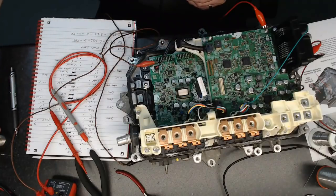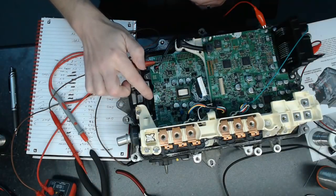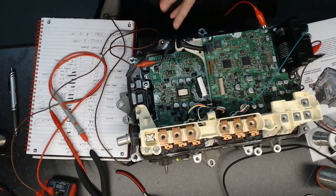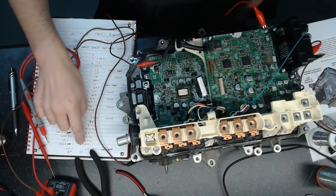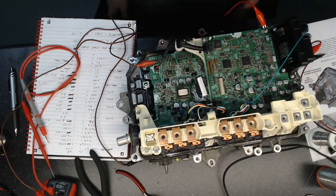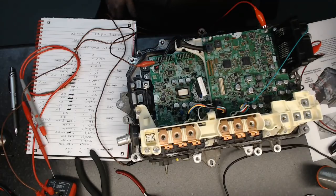And that should then bring up my gate driver. It certainly is bringing it up somewhat, so I've got to try and figure out if it needs another signal. You know, if it needs pin 50 and also possibly pin 49 to be brought up. But let's do that anyway. Some solder, a bit of bridge wire going on here.